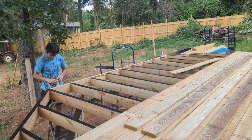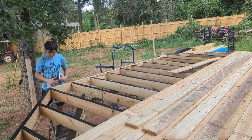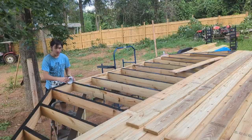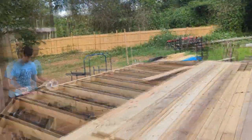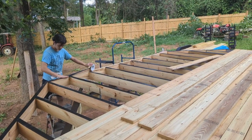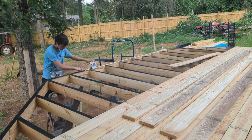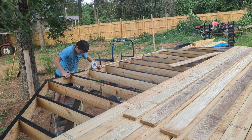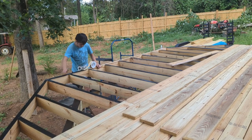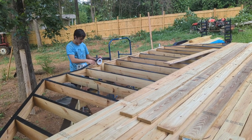I had forgotten to put in this end board here, so we quickly put that in place and now Nick's going to be putting on the joist tape. We completely forgot about putting this board in place. I've got to also do it to those ends of those boards as well, but we'll get to them later. You need to get this end board in here because this is what we're going to be connecting the deck rail post to. It's going to be connecting to this board, and then we'll have a trim board that goes around in between all the deck rail posts.